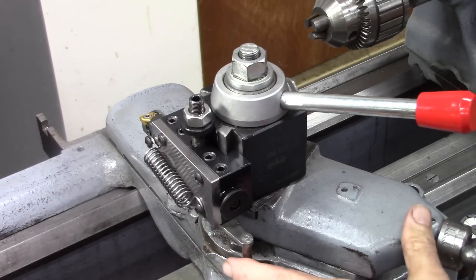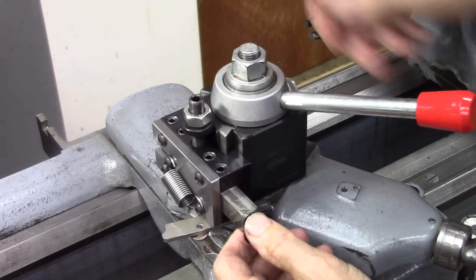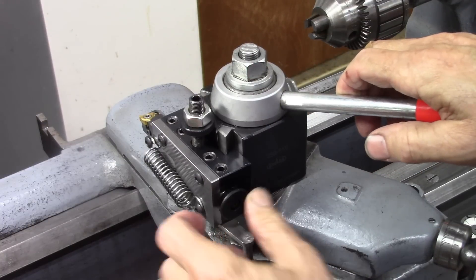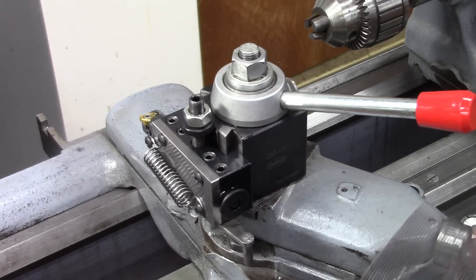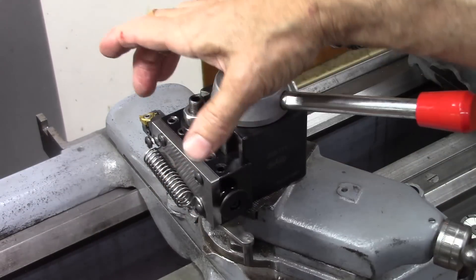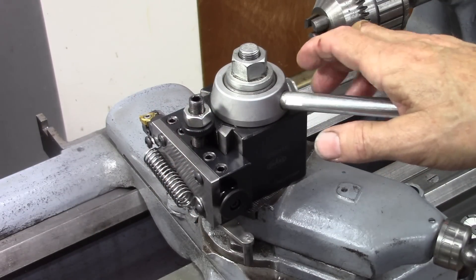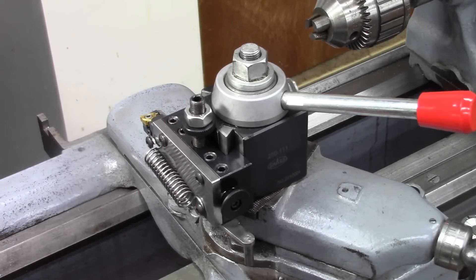Every time the trigger trips and retracts, it acts like a little slide hammer. Over a period of time throughout the threading process, it tries to rotate the tool post — but the mesh underneath there fixes it. Craig said he was going to do some things like try to lighten up the mass of the threading tool itself. Anyway, that about wraps it up for today. Thanks for joining me. Be sure to subscribe and ring that bell.